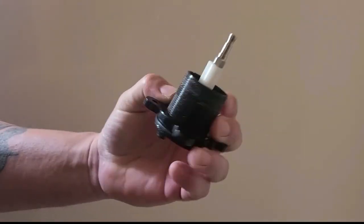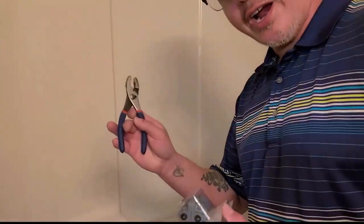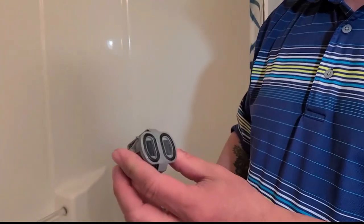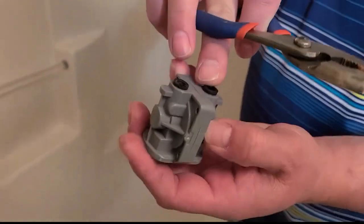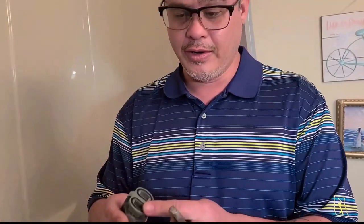That's your whole temperature gauge here. Now that we've got this piece off, we're going to go ahead and take the old piece that's behind it — it's called a pressure balancing cartridge. All you have to do is take your pliers or needle nose, grip it and pull it, and it just slides right out. This is the old piece right here — it looks like some of the pieces are messed up on it, which is probably why it's making it leak. When you install the new one, you'll want to get inside there and clean it out, get all the dirt and stuff. Maybe use a flathead screwdriver to scrape and get all the loose stuff out of there, so that when you put the new one in, the gaskets will fit right in there and make a seal.